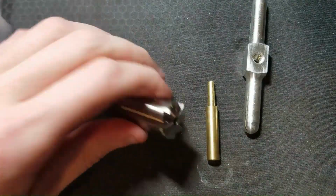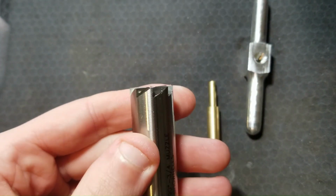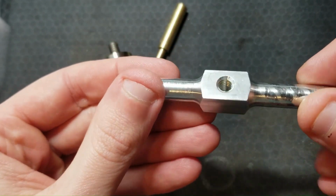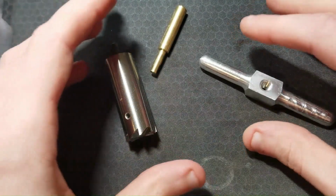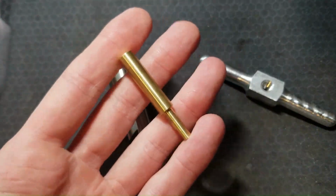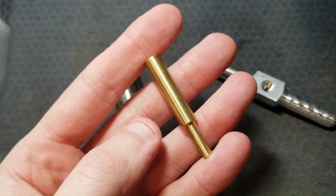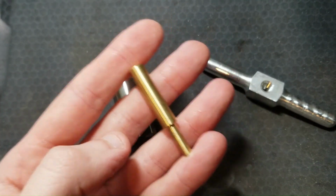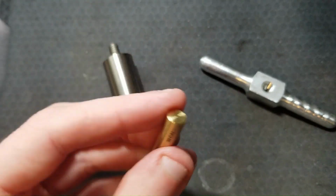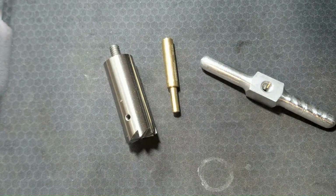From Brownells, I got this 90-degree muzzle cutter facing tool, a 30 caliber pilot, and this little screw-on T-handle. All of this together was $100. There's more than one pilot diameter for 30 caliber bores. I ordered the .2963 diameter because it was the closest to my .295 bore alignment rod that fit nicely in the barrel. I will link to all of these tools in the description.